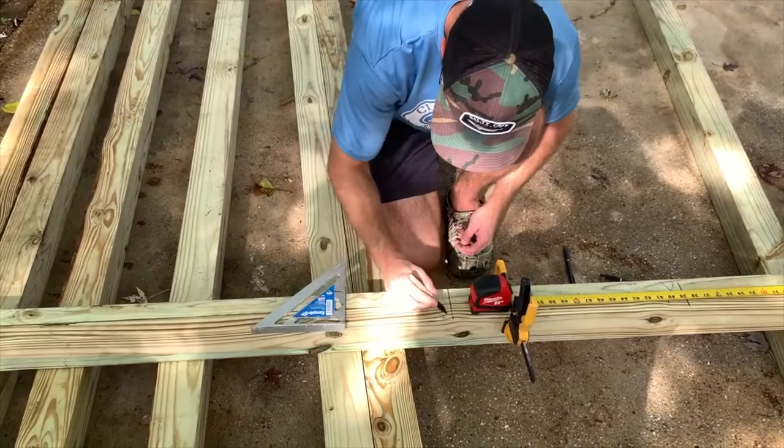And then what you're gonna do after you get the base trim positioned is you wanna measure the actual length for the ProSlat panel. And in this case, it was right around 16 1/4 inches. So I set up a stop block on my miter saw so that all of the lengths would be the exact same and I wouldn't have to measure each time. And after establishing that stop block where it needed to be, I cut all of the smaller ProSlat panels to length.